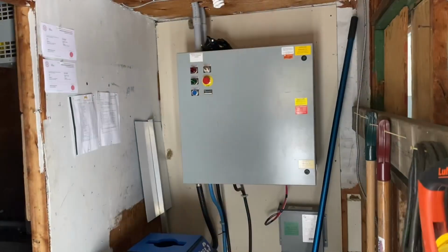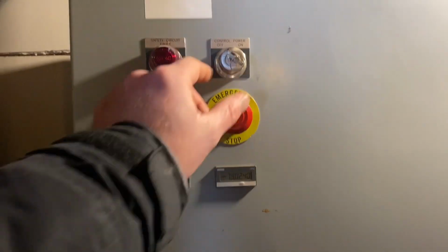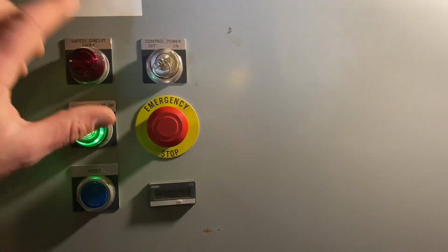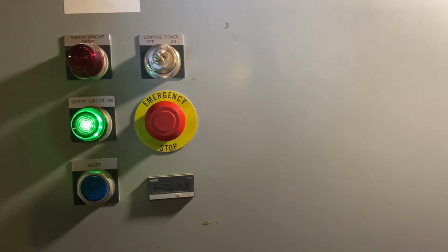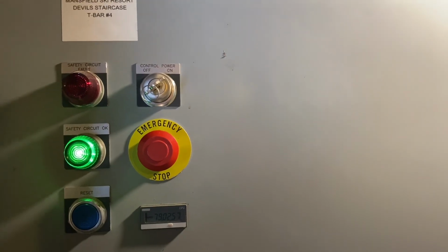So follow me. All right, so here's the back control room for both the T-bars. Get a little light here. So we got our main breaker panels, so we're just gonna get those on. That. And that. So control power on and reset. Oh, that's great. So you can see here I've either got a red light or a green light. If I have a red light, there's something wrong with the safety system of that particular T-bar. I don't have a Christmas tree or a PLC to let me know where the problem is. I just know there is a problem.